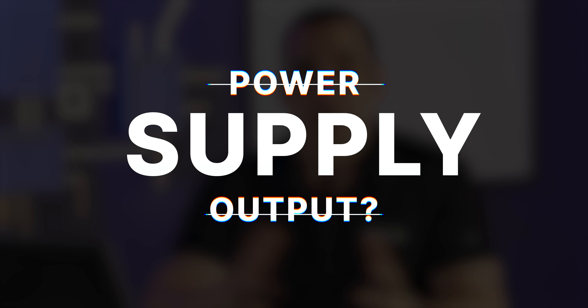Using ferrites can introduce new problems you probably didn't anticipate, especially when they're being used on the power supply pins of digital integrated circuits. We've covered this use of ferrites as a filtering element on the supply pins of digital ICs — it creates resonant behavior and prevents the digital circuit from drawing power at high frequencies, thus creating noise on the outputs.